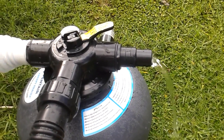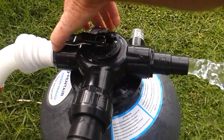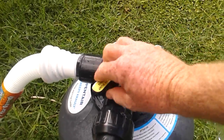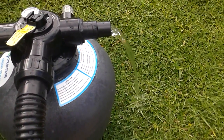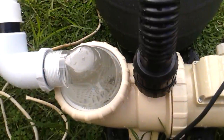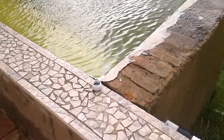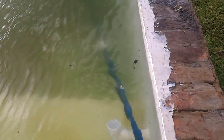I will switch it off. I will now turn it to rinse. I will switch it on. Nothing happens. You can see the pump is running, not very strong. Just as a matter of interest, I will go show you the suction that I currently have. Nothing at all. And exactly the same happens when I put it on backwash.